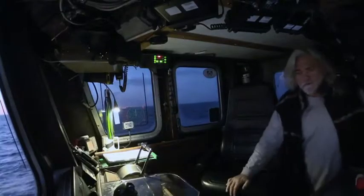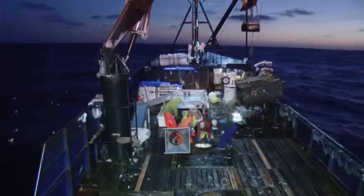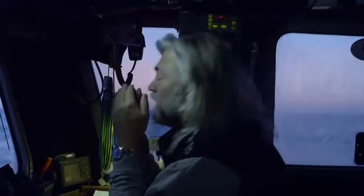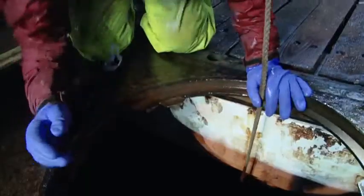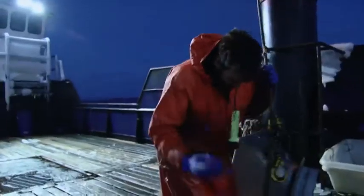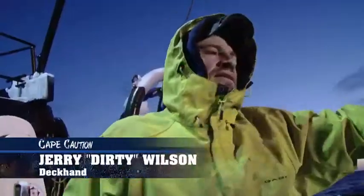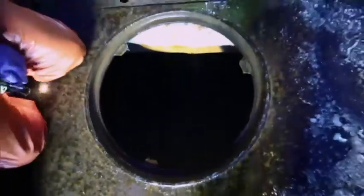The skipper discovered the slack tank in time. Get the water out of the tank. Go make sure these pipes are in good shape. But the plumbing inside may have been damaged. I'm going to go down in the tank and take a look at the piping. A lot of times that water will move around real violently and destroy the piping. It causes a lot of damage to the tanks.